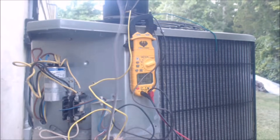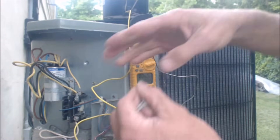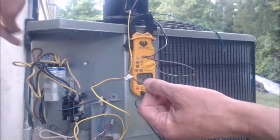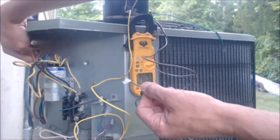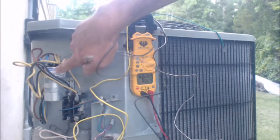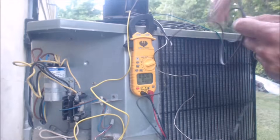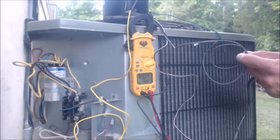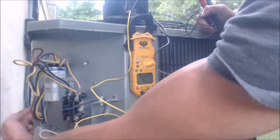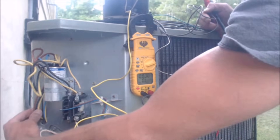So your yellow is connected at the common terminal or at the contactor, the brown/white wire is wire-nutted inside the cabinet, and your other brown wire goes onto the fan terminal of your capacitor — it'll say 'fan' on it. If you don't know which wires are coming from the condenser fan to the capacitor, you can look inside the condenser from the top and trace the wires.